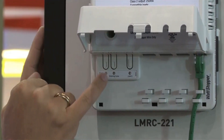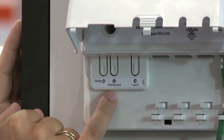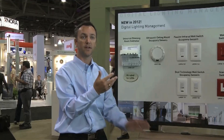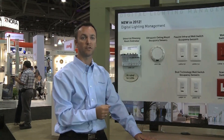There are three options. By pressing the button, you're stepping through the different dimming curve options, and the LED underneath blinks accordingly to confirm which load has been selected. There's no flickering experience — you have the right load right there and it works just the way it should be.